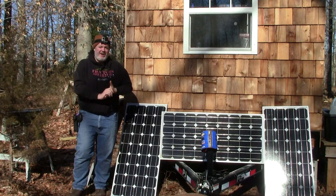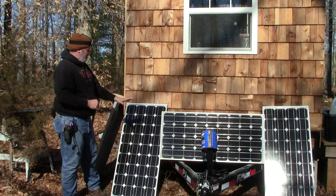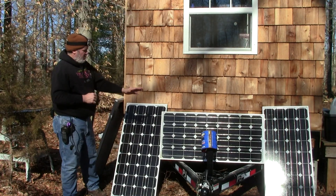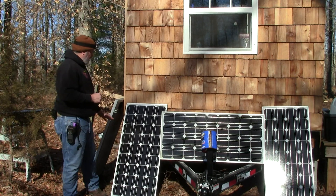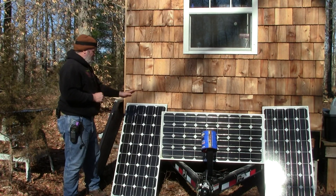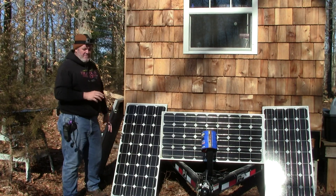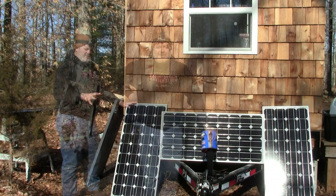Got all of my solar panels hooked up in parallel. So the shadows as they come across from the trees and stuff as we go through winter won't degrade the energy coming out of any one particular panel, so I'm really happy about that. Some stuff left to do at one point — get them better configured, get them better pointed towards the sun and whatnot. But for now, it seems good.